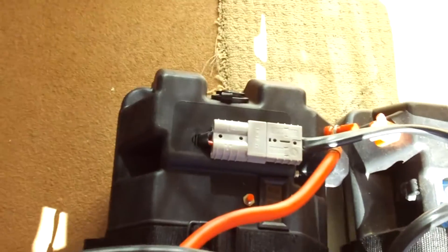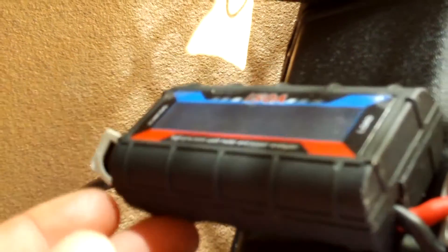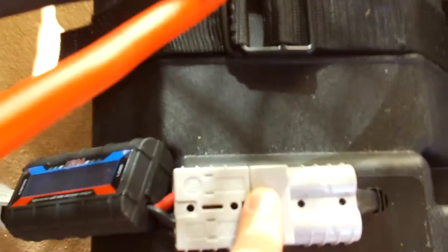Now I've got them running directly into my 125 amp hour battery — I've got two of them now. They're currently punching in around about seven and a half amps, which isn't too bad. I haven't got it over eight yet. These two are in parallel so still a 12 volt system.